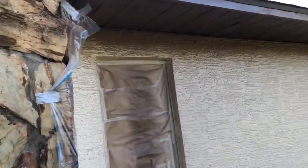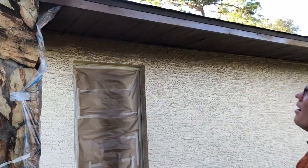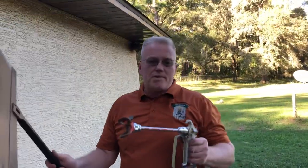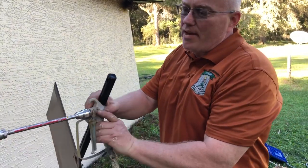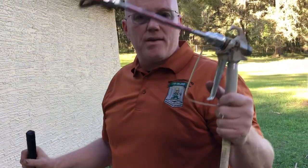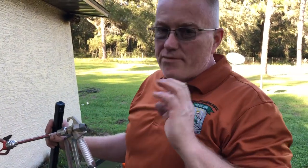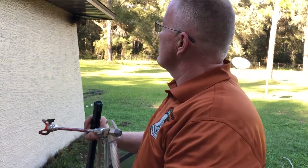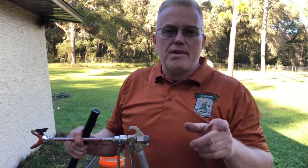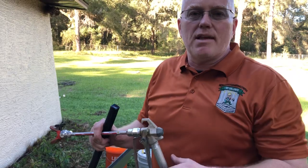I'm going to have to readjust my tape that's come off — I'll need a ladder for that. Just a recap: you have your paint shield, I have a 10-inch extension, and a 313 tip on my Graco 395 airless sprayer. That's how you spray a soffit — and all you need is one coat for a very nice thick even coat. If you have any questions about this machine or any of the tools used in this video, please leave a comment below. Click like and subscribe to my channel and hit the bell button so you get all my video notifications.